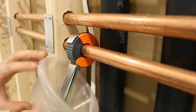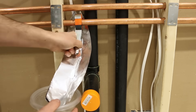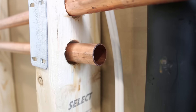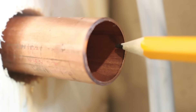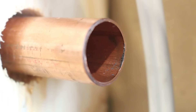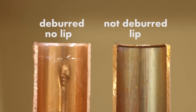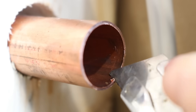There's going to be some water left inside the pipe. If you can't fit a recipient to catch the water, here's a cool trick: get some aluminum foil and use it to divert the remaining water from the pipe into your recipient. Now that the pipe is cut, let me show you the burr. When a pipe is cut with a rotary cutter, a small burr forms inside and needs to be removed. It reduces the pipe's inner diameter causing minor flow loss, and it causes turbulence that could eventually cause a pinhole due to excessive erosion. If you don't have dedicated tools, a sharp utility knife will get the same results.